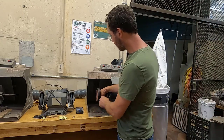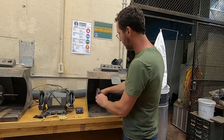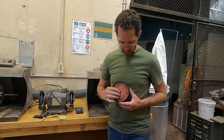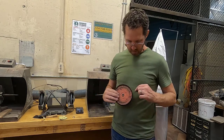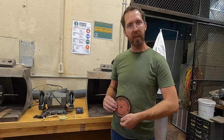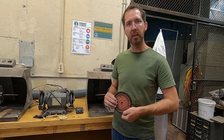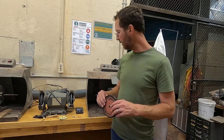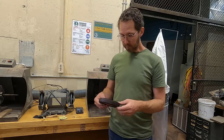To take this off, I'm just going to hold the spindle and spin the wheel towards me. When we are working on the polishing wheel, we want to work between 3 o'clock and 6 o'clock. That way things are just gently tugging away from us. And if we lose our grip, it just ends up down here in the little catch pan.